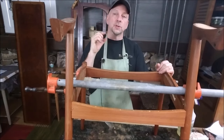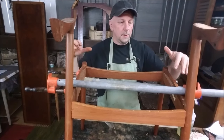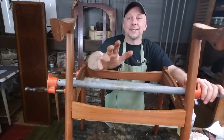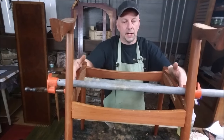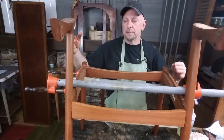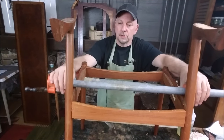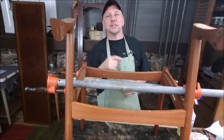That pretty much does it for this particular chair and tutorial. We're going to go ahead and refinish this chair as well. One last tip: if you're not refinishing the chair, when you use clamps you should use some type of wood block inside the clamp so that when the clamp surface goes up against the wood it doesn't do any damage. I'm sanding and refinishing this chair so it wasn't a concern for me. Hope you found it helpful - subscribe to our channel, give us a like, and check us out at werefinish.net.